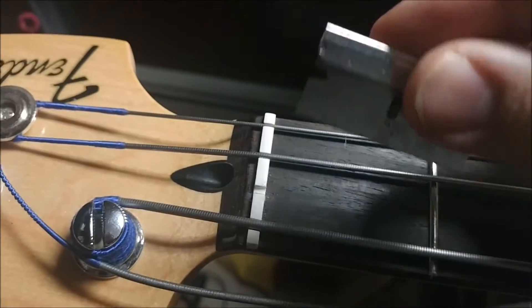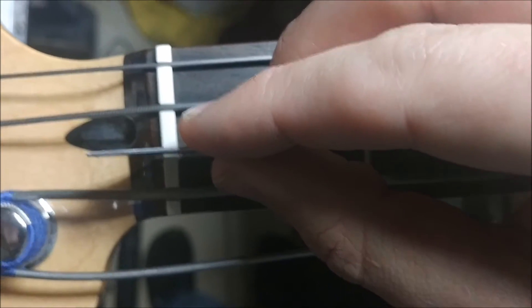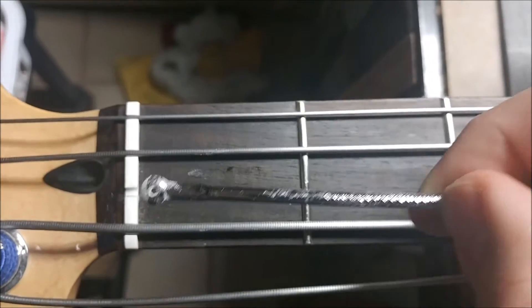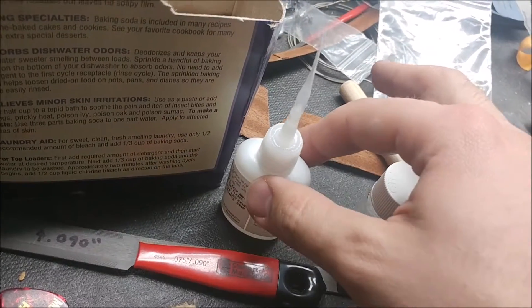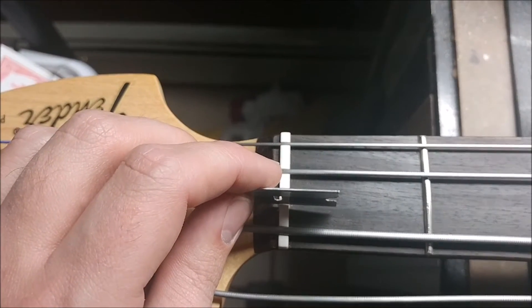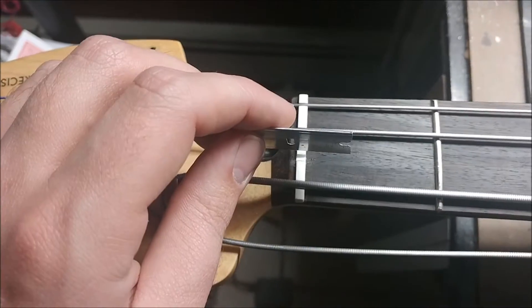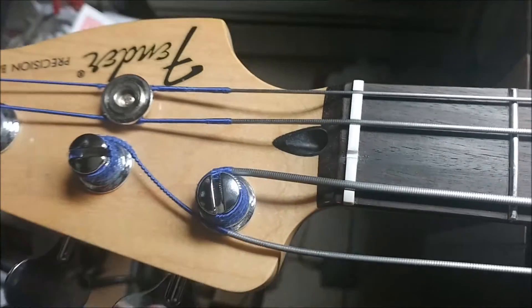What I did here is take a razor blade and just close up the edge a little bit. I'm gonna get it right at the edge of the slot. I'm holding it with that hand. I scoop in some baking soda, add a little shot of super glue with the whip tip, and I just hold the razor blade in place while I'm adding the glue to the baking soda. You can just carefully remove the razor blade and you'll have that wall filled in.